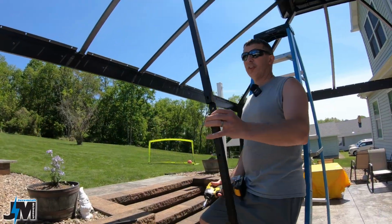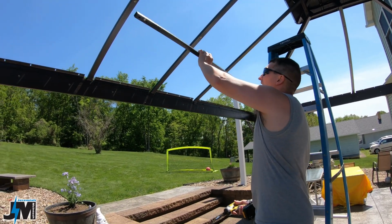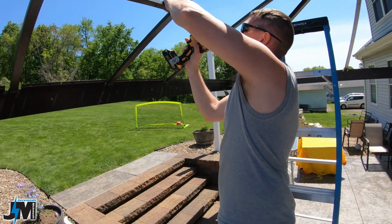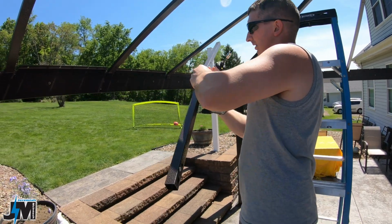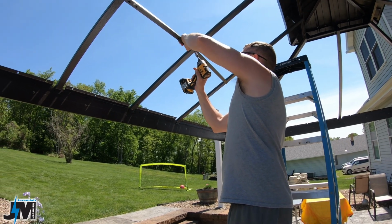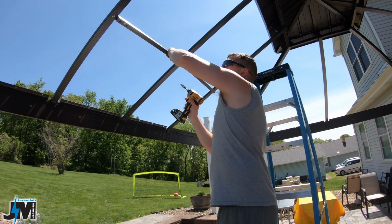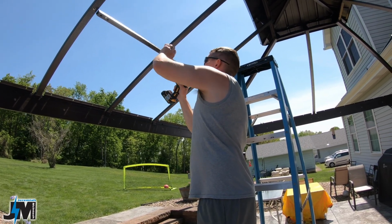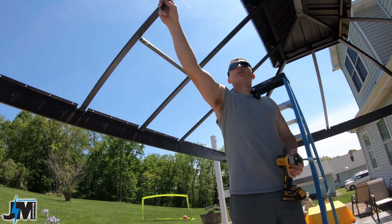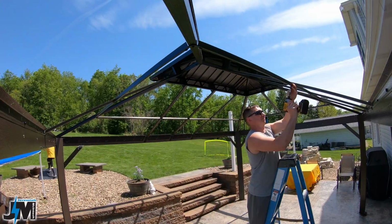Okay, now in this step, this bracket here, which is U5 that already comes pre-assembled, goes in the center here. This just screws up to here like this. I actually have to loosen this up a little bit because it didn't fit. So that screws to the center there. And then I'm actually going to loosen this one as well. That way I got some play here. I'm going to get all these together. They give you these tiers that go in between these to mount those bars all the way around. I'll leave these loose until after I get the roof sheeting on, then I'll tighten everything up.